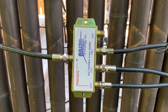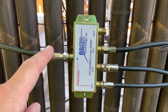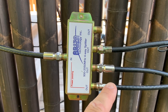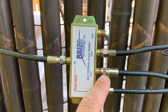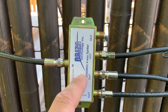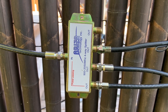Unplug everything before you do anything. I've got the splitter connected here, and the dish I have coming into this splitter is my 39-inch dish aimed at satellite 103 West Ku-band. The power passing port is connected to the receiver in my living room, which will be the control receiver in this setup, passing DC voltage back to the LNB to control polarity. I have two other receivers connected to the output ports which only pass RF signal, not DC voltage — so these will be follower receivers.